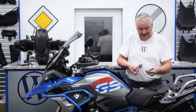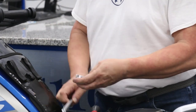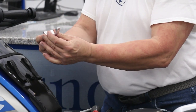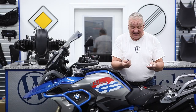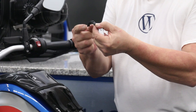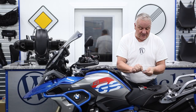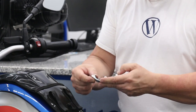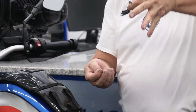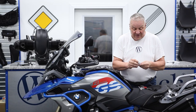Remove the clamps first — these clamps have a hinge and are supplied with rubber inserts, which is a very ingenious thing. You'll notice that there's a long side and a short side on the rubber insert. The short side goes towards the hinge and the little rib snaps right into place, so it holds the rubber in place and it won't fall out. It makes it really easy to install and it's very well thought out.